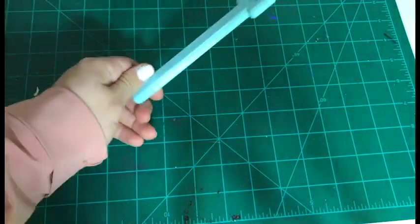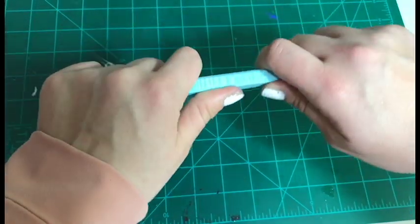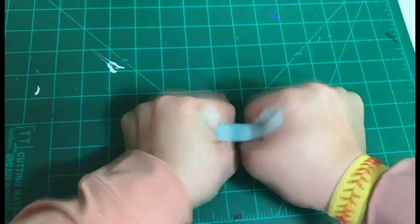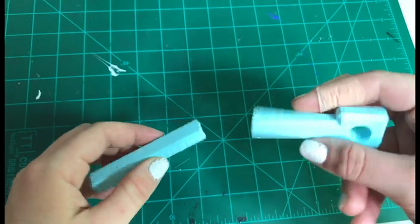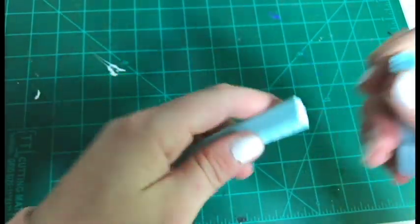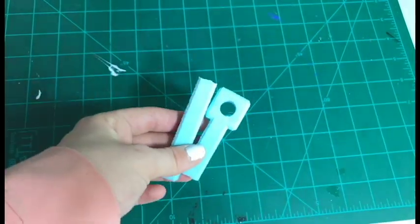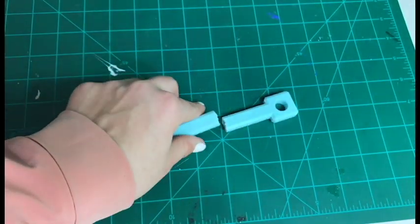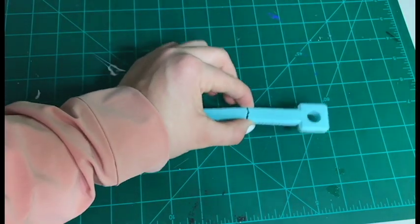Starting with the hand break test — I'm attempting to break this with my hand rather than screwing it down to the table. It's 80% infill. Trying to break it one way didn't work, but it snapped the other way. It took a couple of seconds to break and it was actually a really clean break — unlike the last filament I tested which broke at an angle. It took some effort and was quite strong. If using this outdoors in the cold it may break easier, so make sure you have enough infill for your use case.